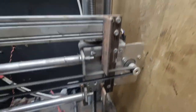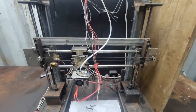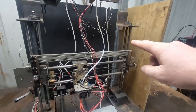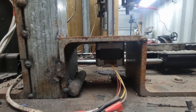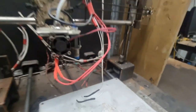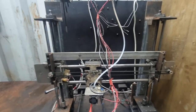On the X-axis we've got a stepper motor up top. That stepper motor has a pulley on it, and that pulley is basically what drives the X-axis. The X-axis is attached to the Z-axis, which is your up and down. Each side has a screw attached to a stepper motor down the bottom. That stepper motor is coupled to the one on the other side and they spin in sync, making this go up and down as the computer tells it to.